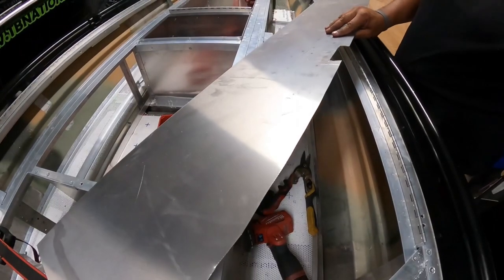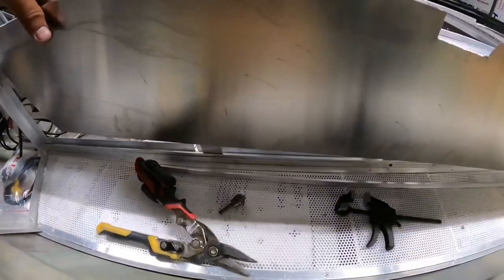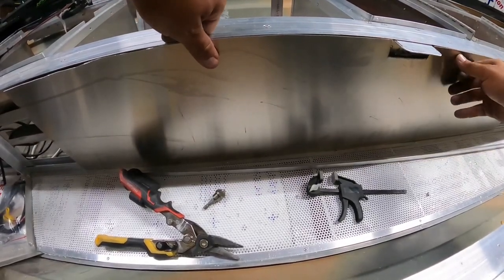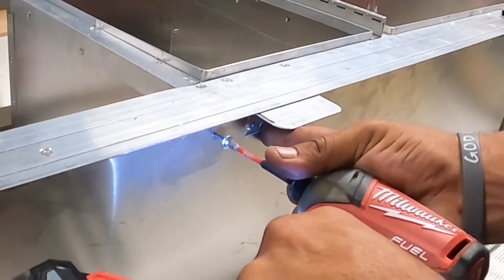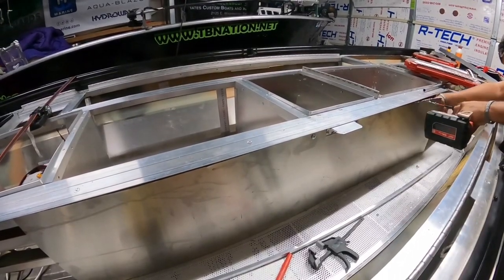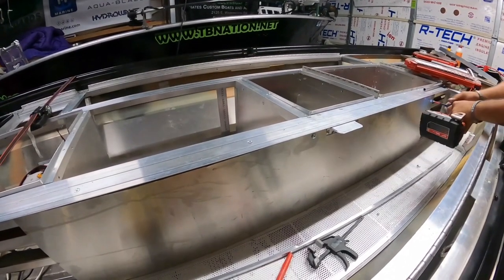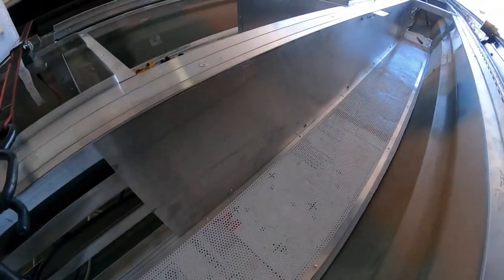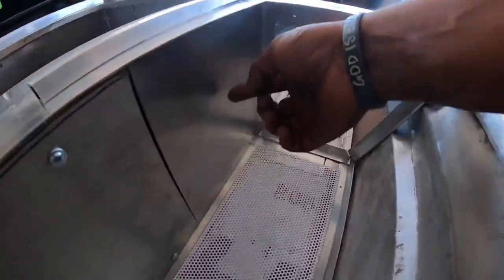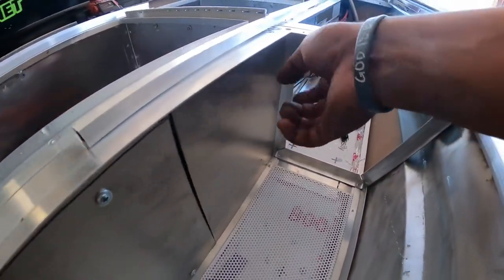And so what we were doing for that is using 0.025 aluminum sheeting for the majority of the side walls that are just mount, set and forget. But for the panels that are re-accessible, to make the boat continuously serviceable, we are using 0.040 aluminum. I have one major section here. This whole panel will come off and I'll still be able to access everything within a few inches. I could slide something 8 or 10 inches down, just not through a whole panel.